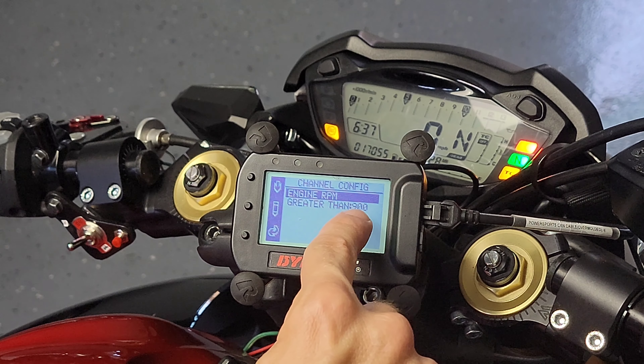I was finally able to remove the insulation, so now you can see the diodes and exposed areas behind the board corresponding to each light. To get the cables inside the casing, I'm using a very small drill bit to open a couple of holes. I'll later fill them with hot glue or another insulator to retain the waterproofing inside the case. Then it's just a matter of routing the two cables through the new holes and bringing them close to the soldering area.